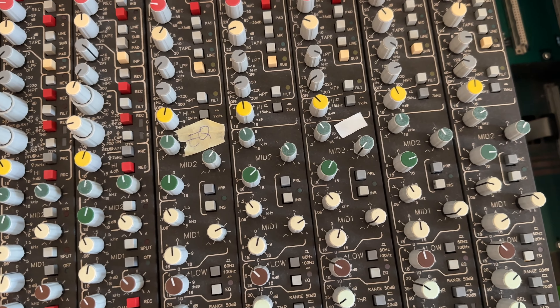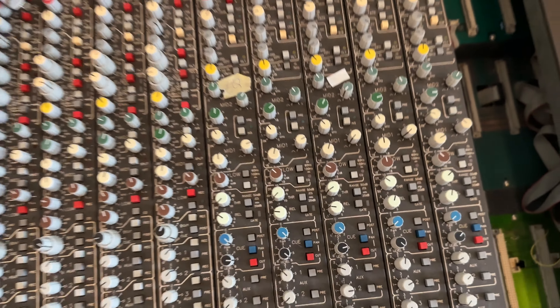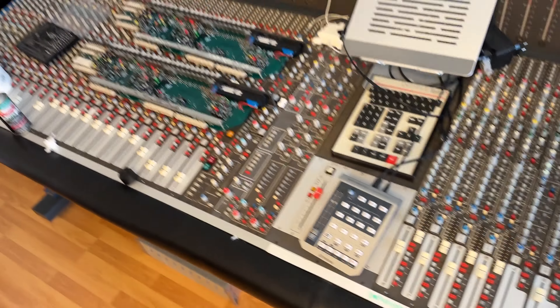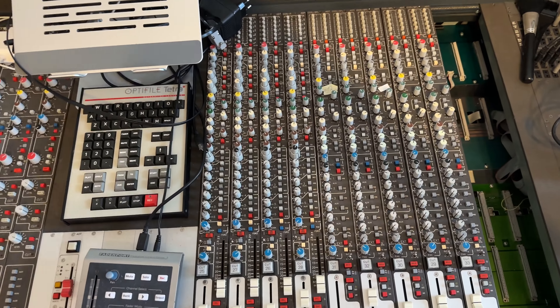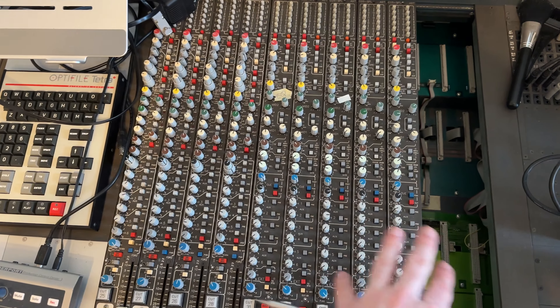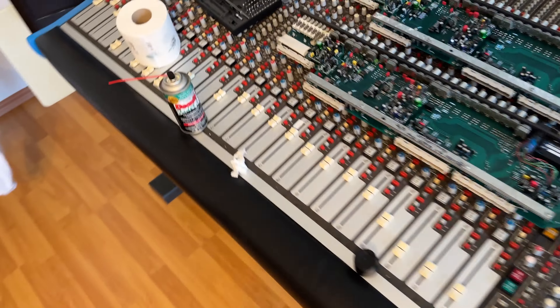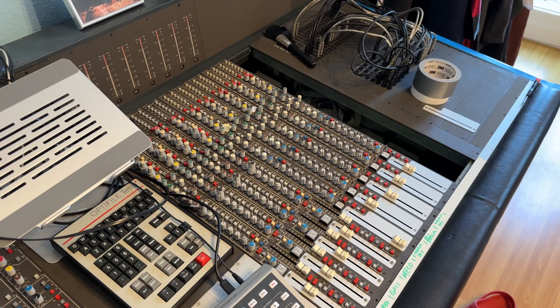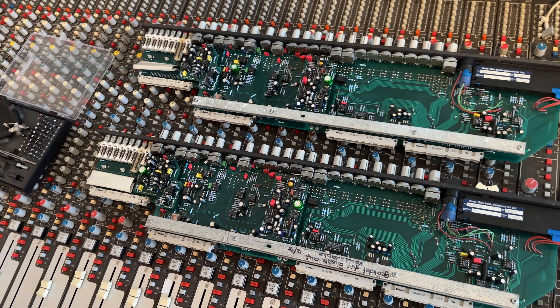As you can see here, I marked some of the equalizers that had problems with the resonance. And when I mix on this board, I have this bucket for drums, so it gets used all the time. So let me just clean all the trim pots with the DeoxIT, set them back in, tune them again and see how that works.